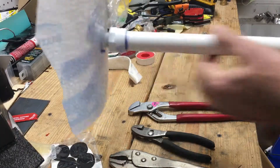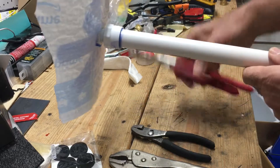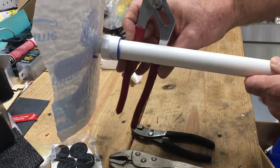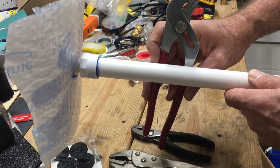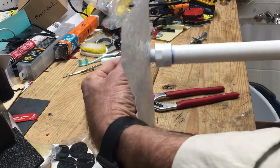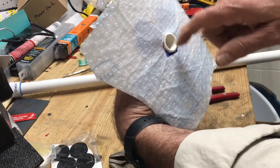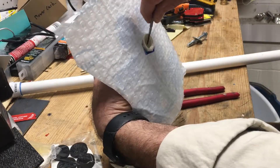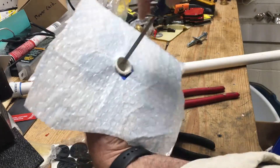Right now, if this is chrome, and if you need a longer arm to get away from the wall so that — let's say this is yours right now — and you want to tilt your shower head down, it might hit that wall where you can't tilt it down enough. So if you had a longer one, you could tilt it down further. Just get pliers and unscrew this from the wall. That's kind of what's in the wall there — not plastic of course, it's brass or something — but there's threads in the wall that are a half inch. When you get it off, clean those threads out a little bit with a screwdriver or something like that and make sure these threads are clean.